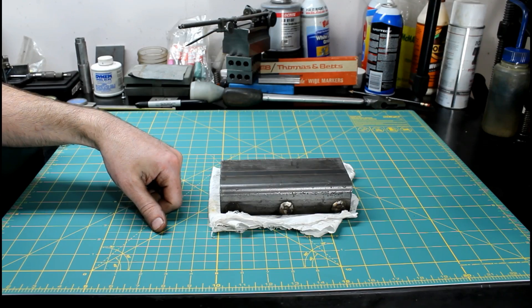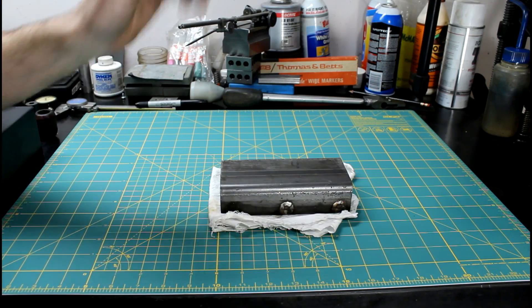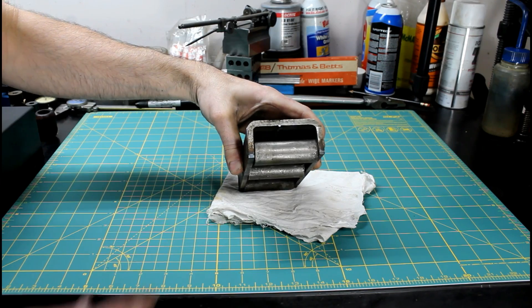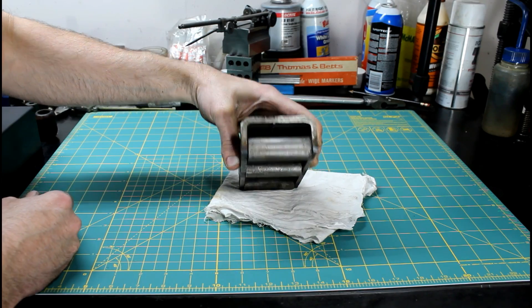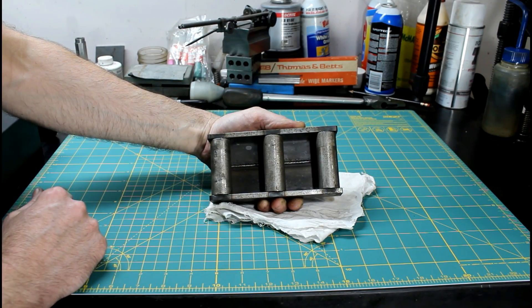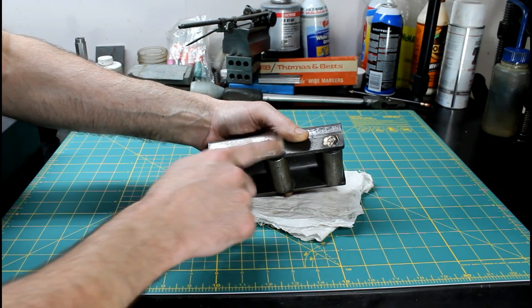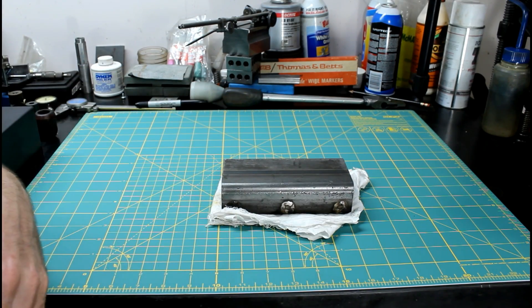They did work but I think they could use some improvement. We're going to texture this top surface on the shaper skates and try to make these even better. They're pretty simple — it's just a piece of quarter inch thick square tube that I cut in half basically, and then we got some mild steel rounds that I drilled half inch and then run some half inch rod through and welded them solid. Real basic but they serve the purpose.